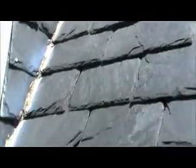This is the area above the dormer here. It's caulked all the way down here. Could re-caulk it. Looks like the caulking has come off a bit along the window here. And there is one piece of slate missing on this edge here. Could re-caulk this area along this wall as well. Recommend sealing all these windows as well along the edges.